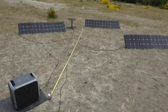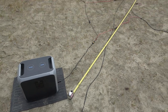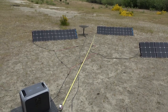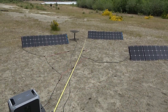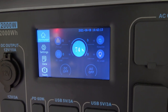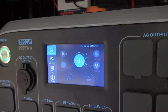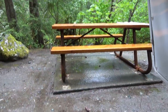With the OEM setup you don't get a huge amount of wiring — the panel as far as I can get it is about 18 feet from the box, although you could add an extension with fairly heavy-gauge wire without losing too much power, because these panels are wired in series giving 60 volts, which limits wire losses compared to a parallel setup. The morning hours were pretty good with a few good hours of sunshine, but the afternoon was mostly a bust. I got back up to 74% overall before it started raining again and I packed up.